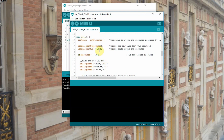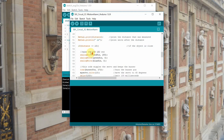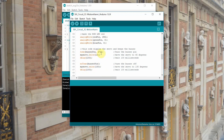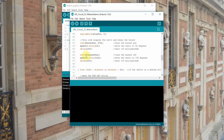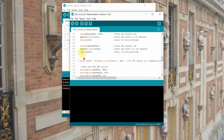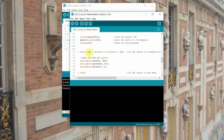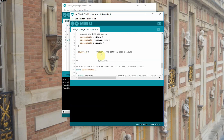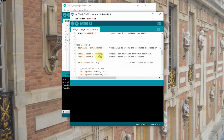We get our distance and can print it to the serial monitor. If distance is less than or equal to 10, the LED goes red — and this code also wiggles the servo and beeps the buzzer. tone(buzzer, 272) generates the tone; myServo.write(10) moves the servo with a delay of 100, then noTone cuts the buzzer sound, myServo.write(150) moves the servo to 150 degrees, and we wait one second. Else if distance is less than 20, we go to yellow. Else if distance is greater than that, we go to green. All the rest is the same as before.